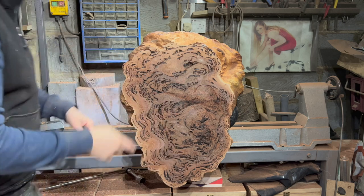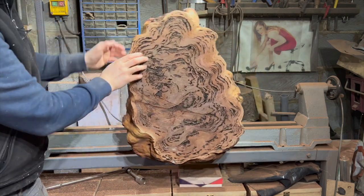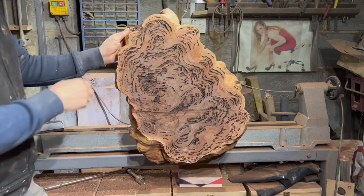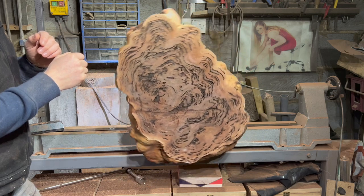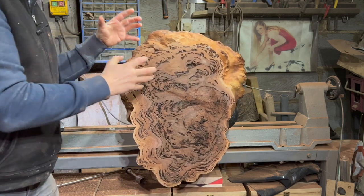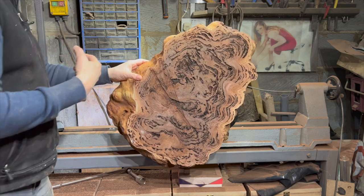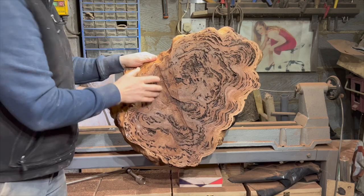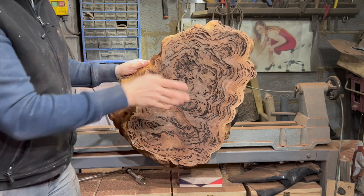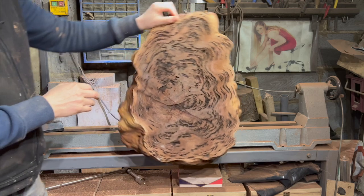Quick update on part two which isn't coming out until the next video - this is the other larger piece. I should really weigh it before I carry on further. I've mounted it to the lathe. I'm going to have some fun with the tool rest - work that out later. But I also need to reposition this because yeah, it's a little bit heavy down this end. I need to reposition the grip on the back so it's a little bit more even, because that's going to shake my lathe to pieces. This lathe is called a variable speed wood lathe by Draper - it's a very basic model. The lowest speed it goes is 500 revolutions per minute, which is quite fast for something this size. I need to get the balance just right.